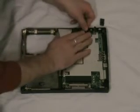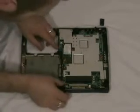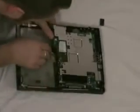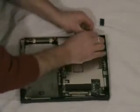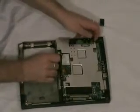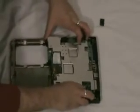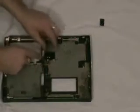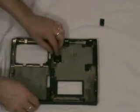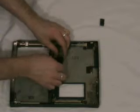Once that's done, you can go ahead and just gently move this into place — and voila! I think my speaker moved underneath the board while I was working with it. So again, you need to be careful because everything doesn't always work the first time. There we go. And I was correct — the speaker had shifted. So you might even want to go ahead and put a dab of glue on that or some sticky double-sided tape to keep it in there because it just comes right out.